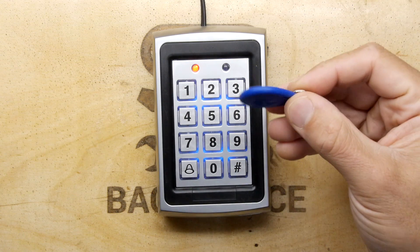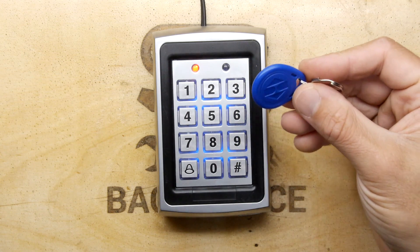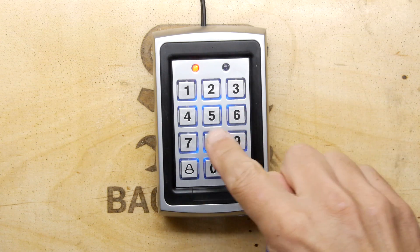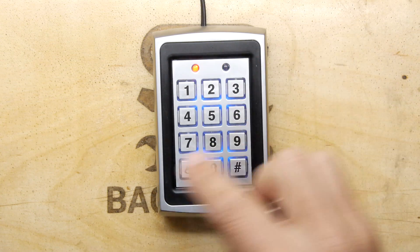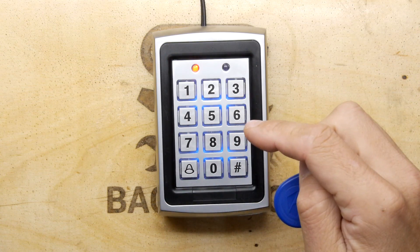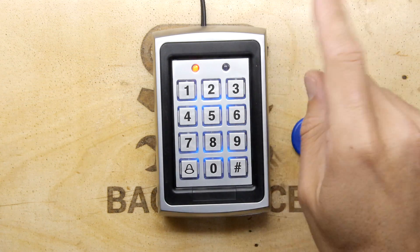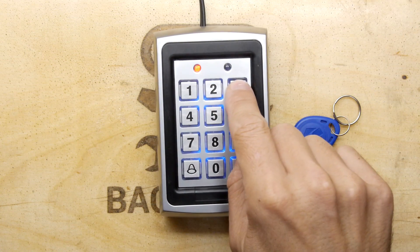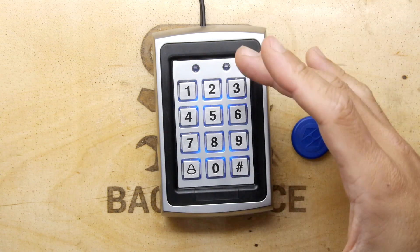An interesting feature is the private PIN, which lets you assign a four-digit PIN to each fob. You present the fob and then have two seconds to start typing the PIN. There's also a standard public PIN — one PIN for everything — and the default for this is allegedly 1, 2, 3, 4. And there we go, we're in. You have to be careful with these defaults: even if you're only using fobs, please still change the PIN.